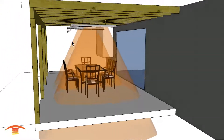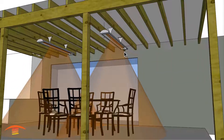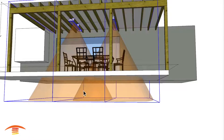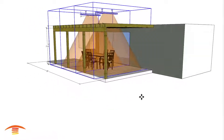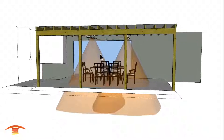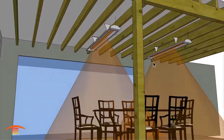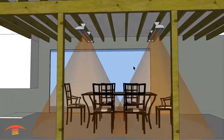Last thing to mention is the height concern. I probably would not select a 6,000 watt unit for a mounting height such as this, because it's really designed for a much higher application. To place them at their ideal installation height would require going up another three feet two inches. If you have these units and want to control them, you could use a duplex switch on each unit — one element on, one element off, or both elements on on a cold day — or you could use a control panel.